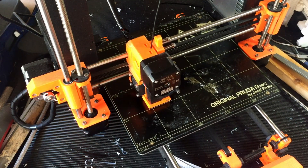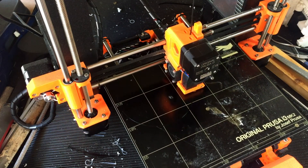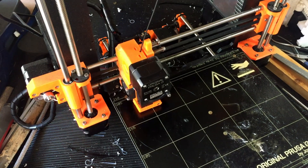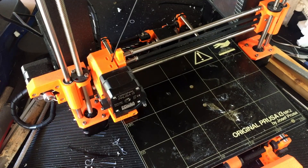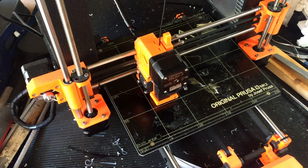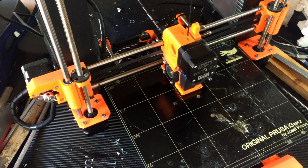I don't find it easy to print with flex filament, but I found that before each print I've reheated the nozzle and made sure I've got a flow of plastic through it, because it wasn't clogging but it wasn't going through properly. Starting from cold, it bundled up inside the drive, so I just pulled it out and put it back in again. I've sort of got a technique now.